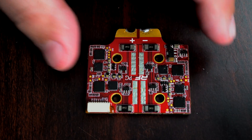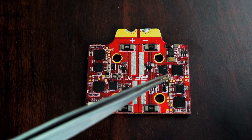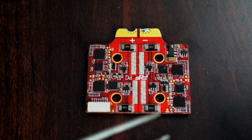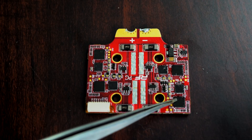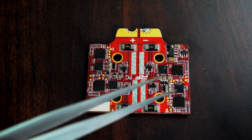An ESC has a smaller version of this. If you look at this ESC, one of these is a FET driver and one is the MCU. These are the MCUs — there are four of them on here. The same thing can happen to them: they can burn a hole in them. There are four MCUs on here and the same failure can occur.